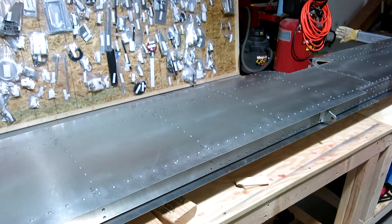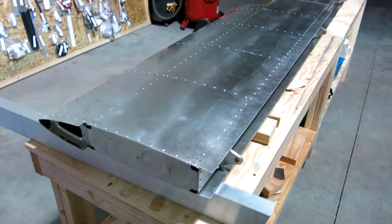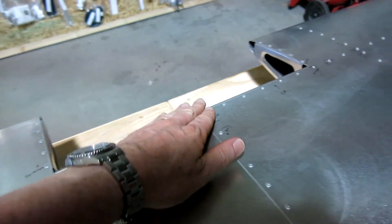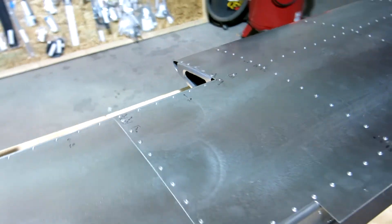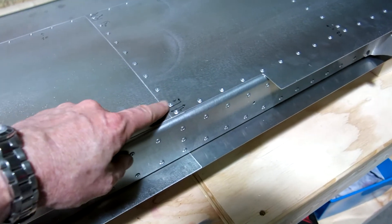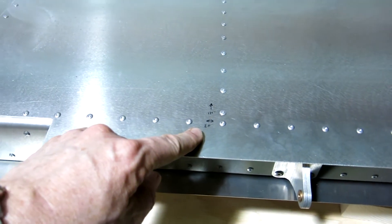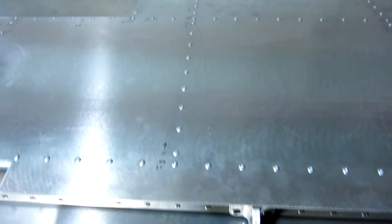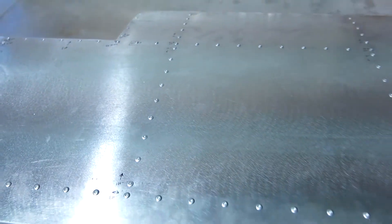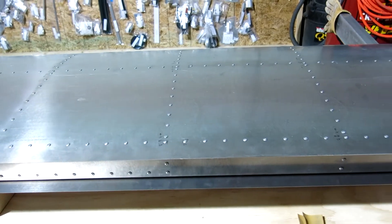We are wrapped for the day. We finished up the horizontal stabilizer and we figure we pulled about 500 rivets today. These flush rivets came out really nice — glad I got the right tool for the job on those. Earlier in the video we labeled on the skin which types of rivets go where, and the arrows told us which way everything goes. That helped a lot. Everything went together pretty well — no major drama on any of this.